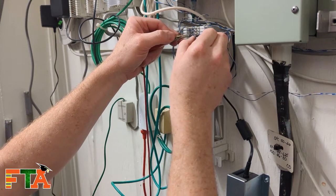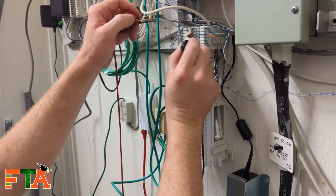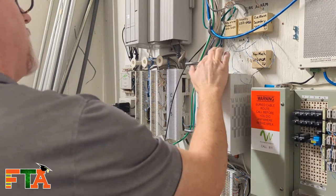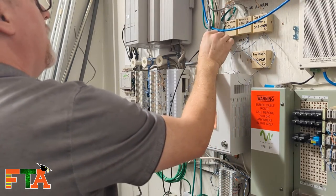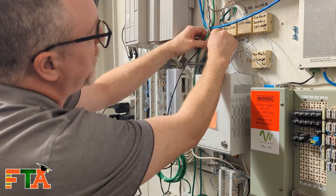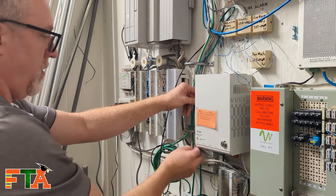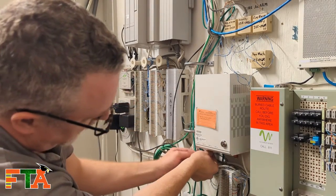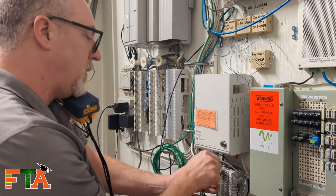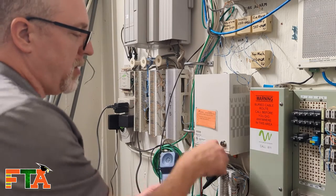I've literally not found any dial tone yet. You can go on the mid-left pair or the far-left pair, because again they're the same thing — it's a U-shape. So we know this is our source cabling, because we verified we had dial tone on this side and we did not have dial tone when we unplugged this. What we need to do is figure out where these pairs go. They're zip-tied in here so we don't have any free movement, but that's obviously our set of pairs. We're going to try to trace these down — they're coming down the end of the block area, and these look like they're going to the block. I do have dial tone there.